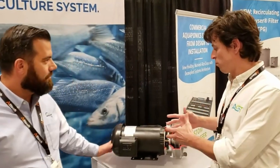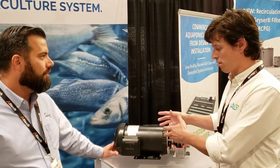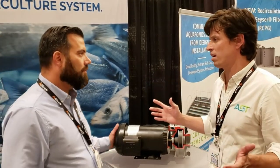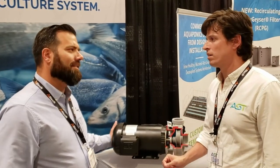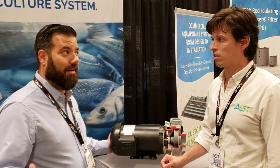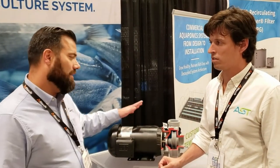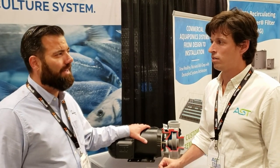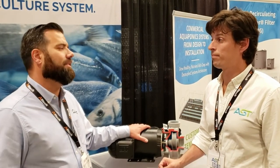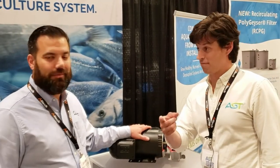So what's your application that you would use for a pump like this? Are we talking like a 10,000-gallon system, a 5,000-gallon? Yeah, probably a 5,000-gallon system. Flow rates and stuff are dictated by the species or the density you have. But this pump can get up to 200 gallons a minute. It shuts off at about 80 feet of head. That would be, of course, 60 hertz domestically. It's different at different speeds.